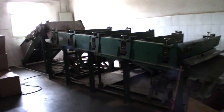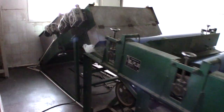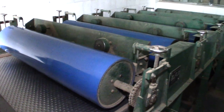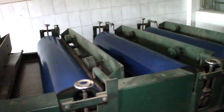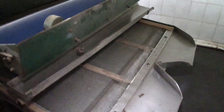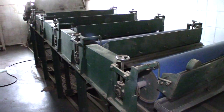This is a pretty cool machine used for processing tea that might be a little bit dirty. The tea gets put into one end and it moves up through five blue rollers that produce static electricity. The static electricity actually pulls the dirt and dust off of the leaf, and then it works its way down where you can do some grading into different piles. We haven't used one before, but it's fun to see them in action.